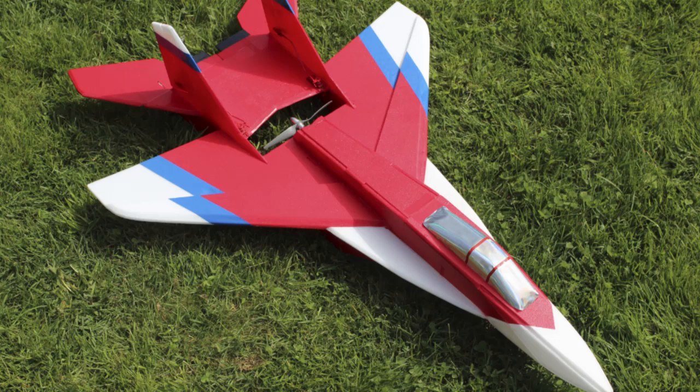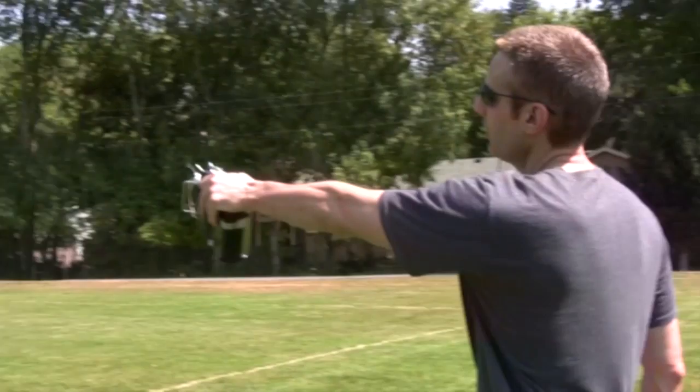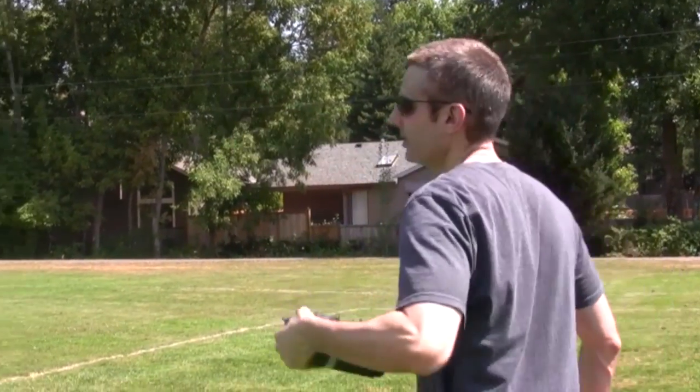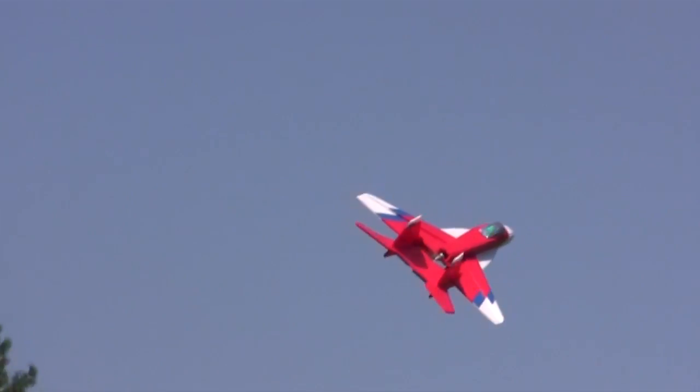We kept finding that so much has to do with the airframe itself — the sleeker, smaller, streamlined design. This is where you can squeeze out a lot more speed. I'm talking 10–15 miles per hour faster by playing around with your airframe versus throwing in a motor with just higher kVs. So with the MiG-29 V4, we angled the wings a little differently, shortened the vertical stabilizers, changed the horizontal stabilizer, and changed the underside — all to get air to slip through just a little bit faster. We wanted the plane to go faster with the same power system as the V3, and that's what it does.